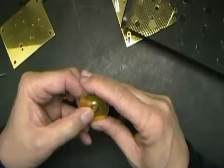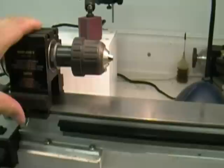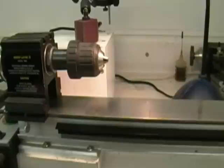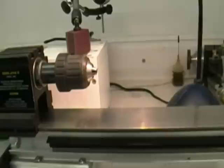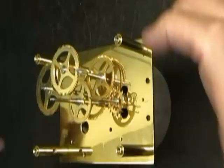This is the polishing jig I'm going to use to do the wheels. All this is is a Jacobs chuck off of a hand drill that I've adapted into my lathe. You can use anything that spins the chuck, like the hand drill itself, as long as you can lock it in the running position and adjust it to the lowest setting — you want it going very slow. The 3/8 chuck is excellent because it grabs about 90% of everything you'll be polishing.